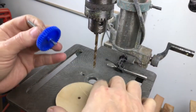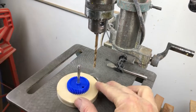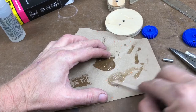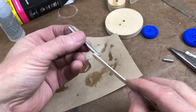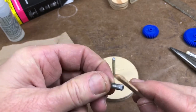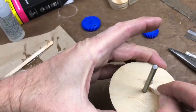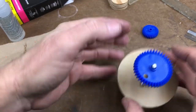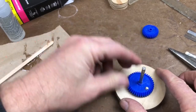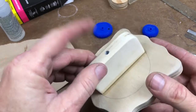The job at hand is to attach this gear to this base wheel — this is the base that everything's going to ride on. I'm going to drill down into that hole and put a pin in there to mechanically lock the two together. I'm going to put a lot of five-minute epoxy on the shaft. I ground a flat on the drive pin, put lots of epoxy in, and shove and tap that in. Clean off the extra epoxy, set the gear on top, line it up with the pin — that pin is going to drive that base. While I was gluing the gear assembly, I also glued the upright onto the base so it's ready to go.